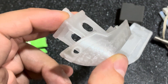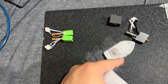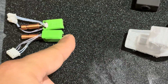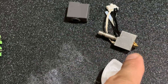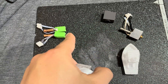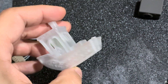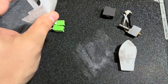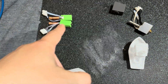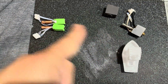However, this should not be looking like this — it means it was printed too cold. These are the exact same G-codes between the two prints. The difference is that the hardened nozzle runs colder than a brass nozzle at the same set temperature. So the plastic exits a lot colder, and therefore you're not getting those bad overhangs. Every default in the Anycubic Slicer Next software is not tailored for these hotends — you need to micromanage every setting to make this work.